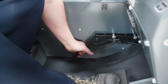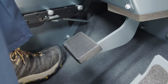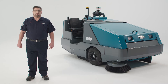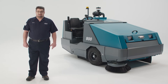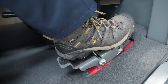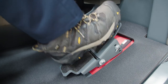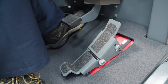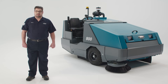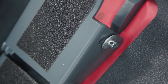This is the parking brake. To set the parking brake, pull up on the lever, and to release it, push down. To slow or stop the sweeper, press the brake pedal. To control the speed and direction of travel, you will use the directional pedal. The harder you press the pedal, the faster the machine travels. To propel forward, press the top of the directional pedal with your toe, and to propel in reverse, press the bottom of the pedal down with your heel. If you take your foot off the directional pedal, it will return to the neutral position and the machine will cease propelling. The top of the directional pedal is adjustable — simply remove the clevis pin, adjust the top of the pedal to the desired angle, and then replace the clevis pin.